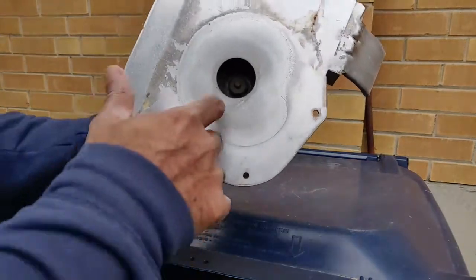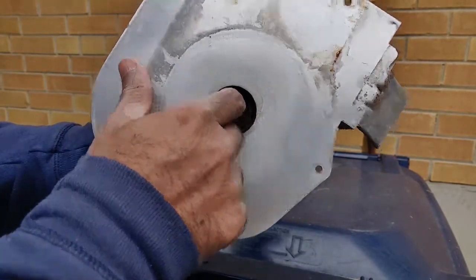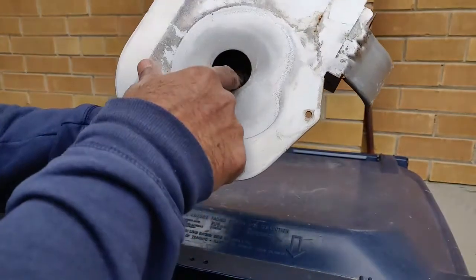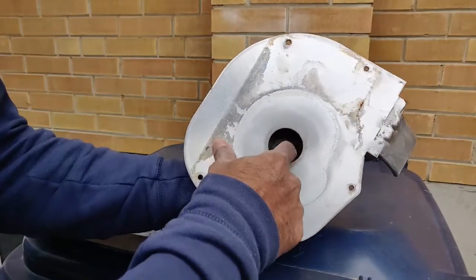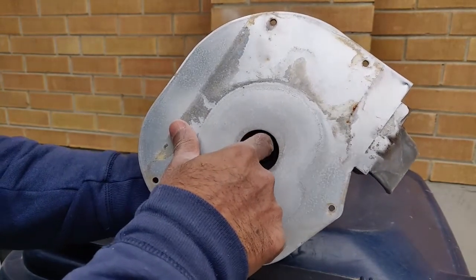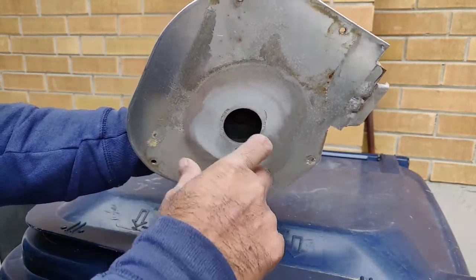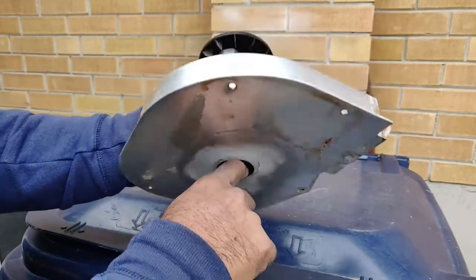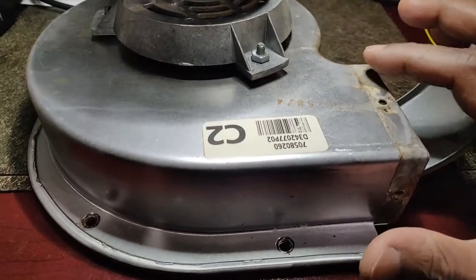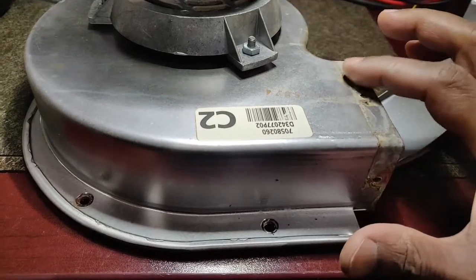Removing the impeller — the blower part — will be difficult. Normally these motors are just replaced, never serviced. I don't want to take the risk of removing it; in case something gets damaged, I don't want any imbalance on the fan blades. Looking inside, the blades are not so dirty. I'll continue with compressed air and see if I can clean the blades a little bit. I'll also use a very fine steel wool to make sure the mating surfaces are really clean, without removing the plating.